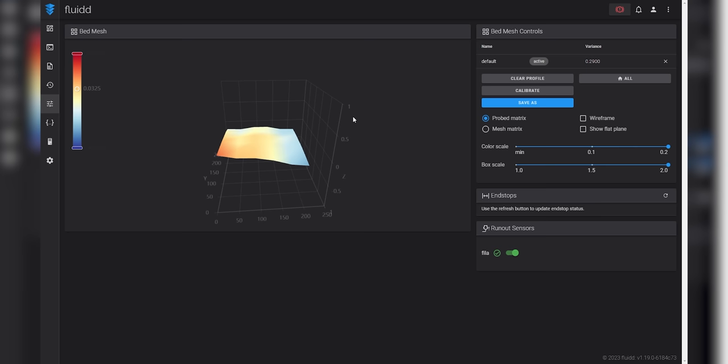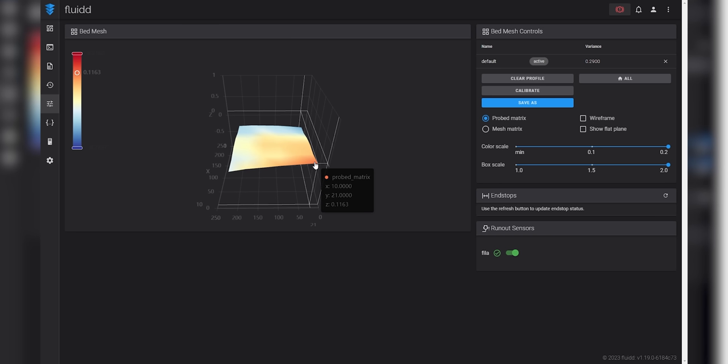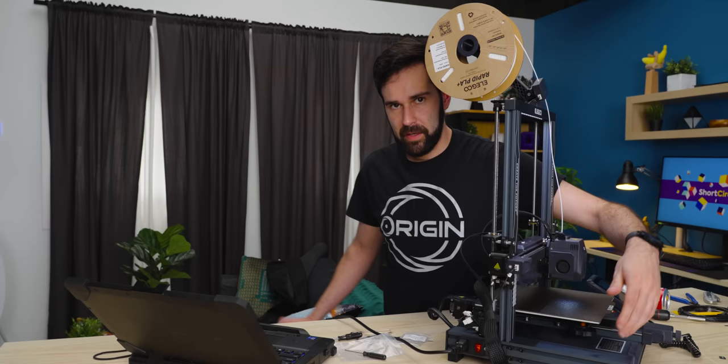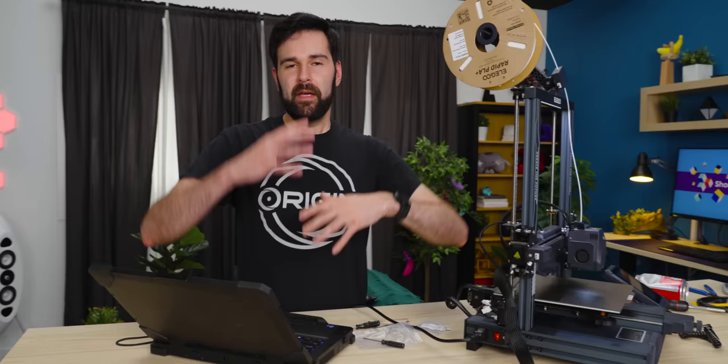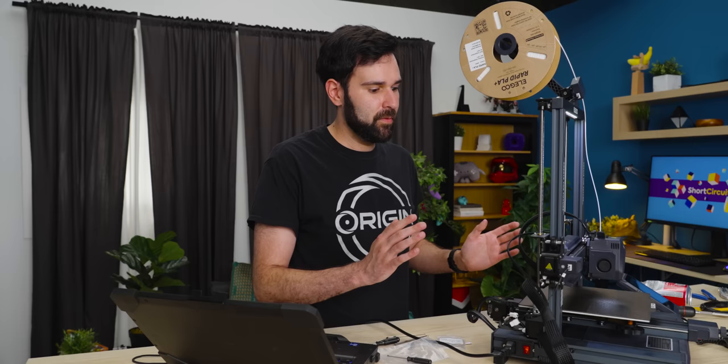We've got a console so we can send G-code commands directly — G1 Z10, G1 Z50. It's in absolute positioning mode. We have direct access to jobs so we can upload files and pick what to print. We even have history — this print was going to take 42 minutes, which is pretty good for a part that size on a Cartesian machine. What's really cool is we have a 3D graph of our mesh bed leveling output — every time I see this I need it on my printer. It's like a beautiful heat map of everything that's wrong with your bed. The X0 Y0 corner is a little bit higher, so I can tell I need to turn that knob a little bit. You can get immediately into really fine-tuned printing — and this is just firmware. Why doesn't every single printer have this kind of interface? We have all the configuration files — stepper pins, full steps per rotation, pulse duration, everything I want access to.